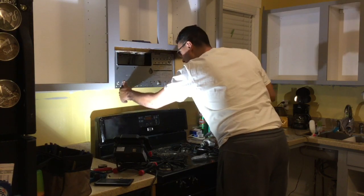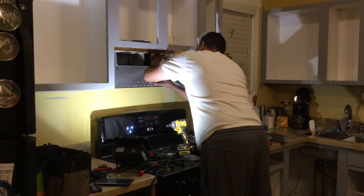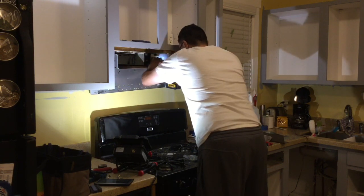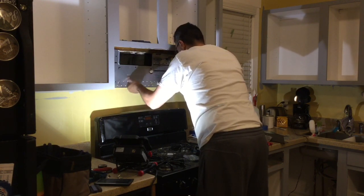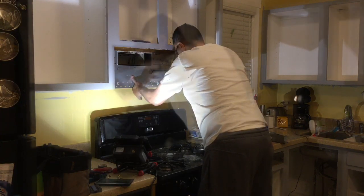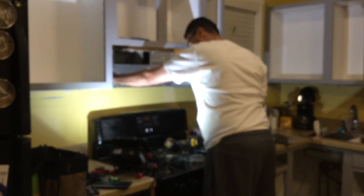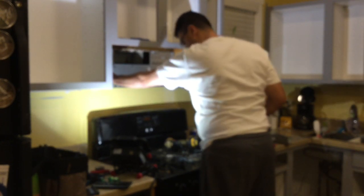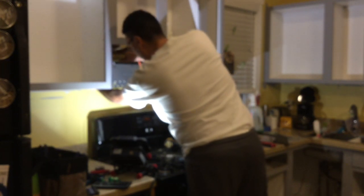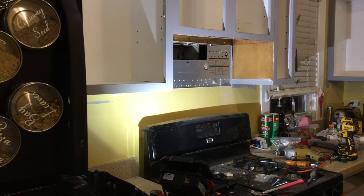Now that it's all drilled out, we grab our bracket and mark our wall holes. We're going to be mounted to at least one stud — you only get one stud because wall studs are 16 inches on center and this is a 30-inch opening. So the right side gets lag bolts from the hardware kit going into the stud, and the left side uses hollow wall anchors from the hardware kit. With two lag bolts into the stud and two hollow wall anchors, it should be more than enough to hold the unit up. Once everything is secure, our bracket looks like this.